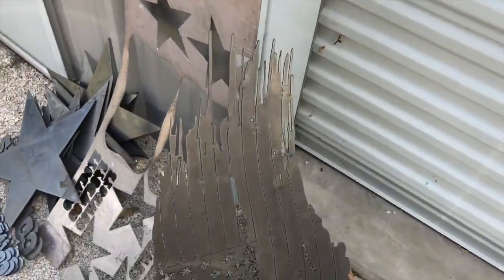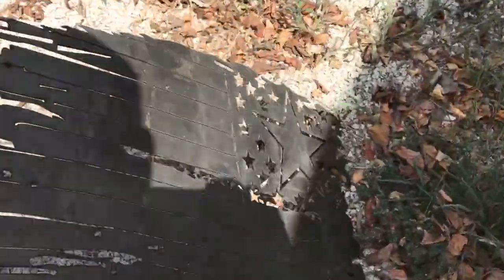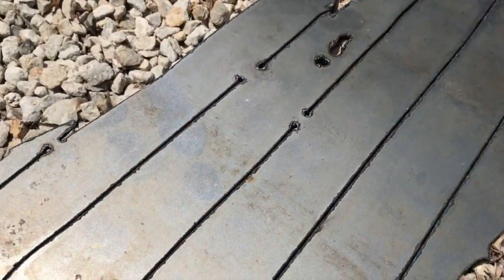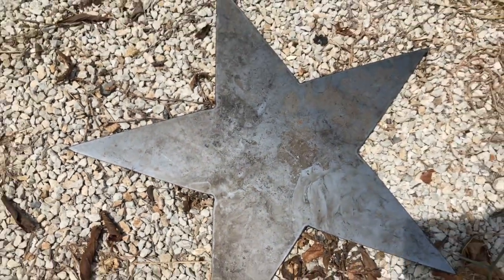Here's the stuff I just cut out. Here's the flag that we cut at 200 inches a minute — let's take a look at the back of it. Let's get this in the sun where we can actually see it. You can see up in the stars there's a little bit of dross here and there in the straightaway areas, it's pretty clean. On the 600 inches a minute with the 85 amp tip, these are basically dross free. You might see a little bit in a corner here and there, but on the straightaway edges there's nothing there. That's the backside just as it came off the table.